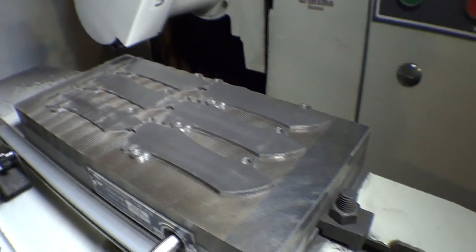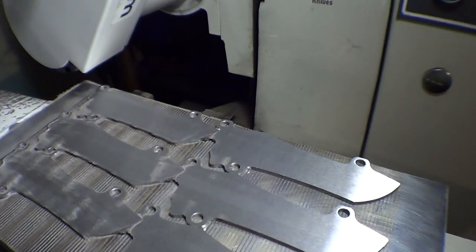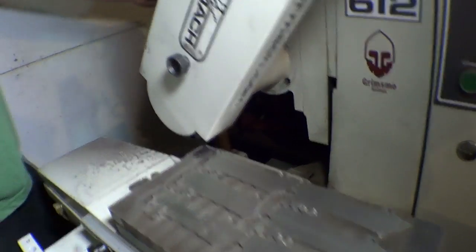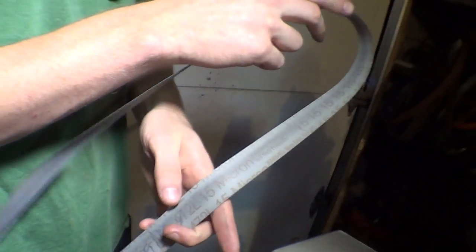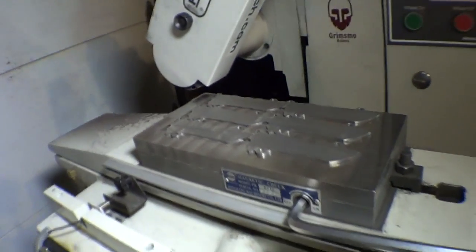I'm not going for a final surface finish — not at all. I'll do it again afterwards, after they're all milled and I know how the blade is going to end up. I have other belts, like some micron belts for the grinder, and they work really well to bring it up to a closer, nicer surface finish. Do you run those soft or hard? Hard — all at the end. These are soft right now but at the end I do it again hard.